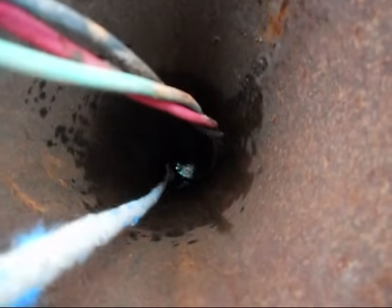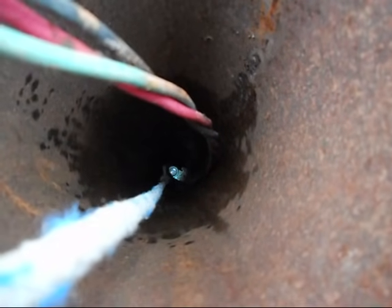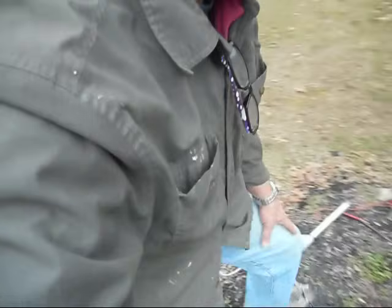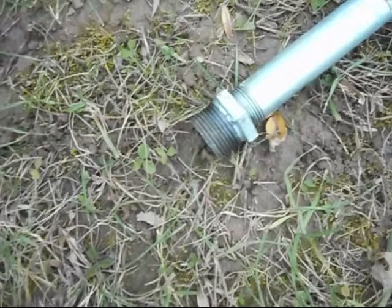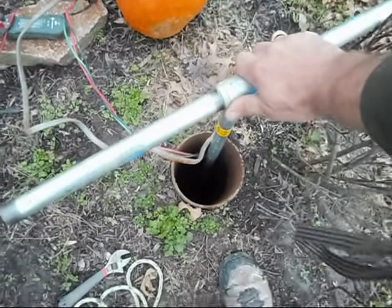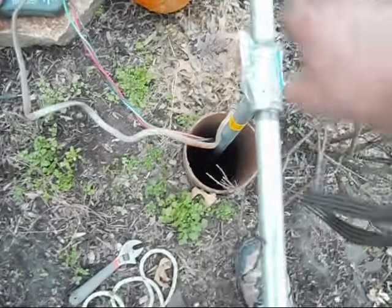If you get a flashlight — there it goes. There's what I think is called a shoe fitting that is down about four feet. Once we can get that out, that's what connects to the inside of the house. This little guy here threads down, and I think it's a three-quarter inch threading. That's going to connect to the shoe fitting, and hopefully we'll be able to pull it out. I'm pretty sure that the threads are not crossing and it's threading into the shoe fitting.